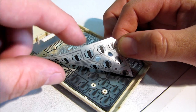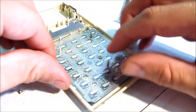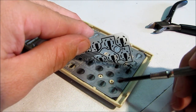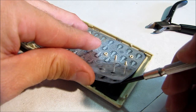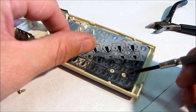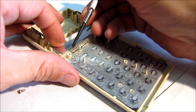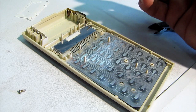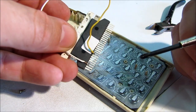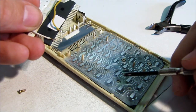So what we're doing is we're bypassing that switch. I need to follow the track that runs from this pad and follow the track that runs from that pad underneath. If I lift it further up I'll see it comes onto pin number 3, and I know the top one — because we traced it earlier — is that pin that I marked over there. So what I've done is I have soldered a wire to pin number 3 and the pin that I identified from the top layer.